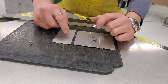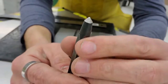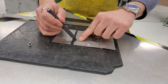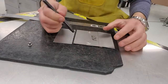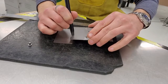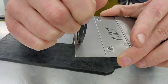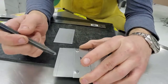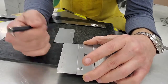The center punch is this tool right here — it's got a kind of sharp tip. We're going to use it to put a little dent right on the cross where those two lines cross. That way when we take it over to the machine, the machine has a flat punch but with a tiny point, and we can set it in. It's kind of hard to see, but when we have that dent we can wiggle this around and feel when the point drops into the dent — that's how you know it's exactly where you want it. So we're going to go over to the stake table, center punch these four marks, then go over to the turret punch.